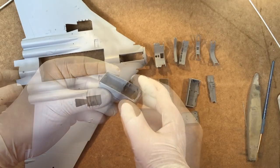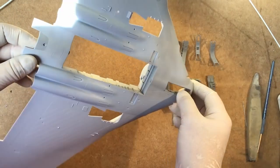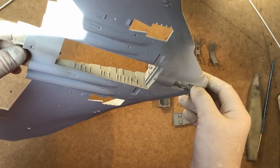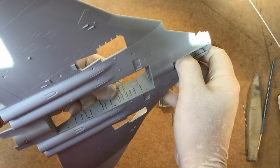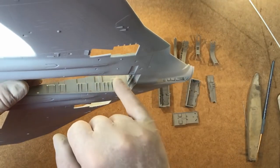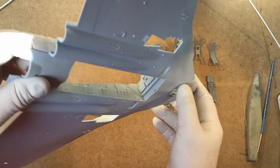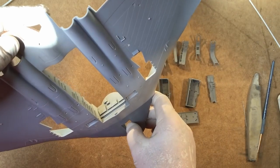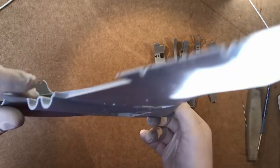We'll see. So as I said, I'm going to leave that because it's too warm in the shed at the moment to do any painting. I'm just worried that I'll get the paint drying before it hits the surface, and that'll leave nasty grainy paint on all this, and it'll take an awful lot of cleaning up. So I don't want to risk that. I'll wait until it's cooler this evening to put the paint on.